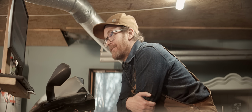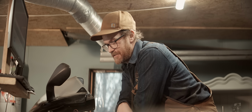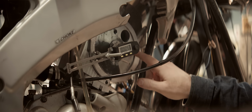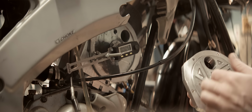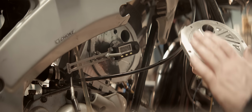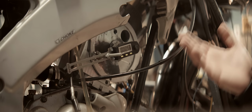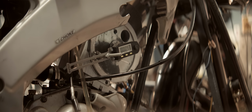Well, these are uplifting results nonetheless, because the engine is running, it's not overheating, things are working. I've pulled the rotary valve cover and everything looks better than last time. There's still some wear and there's still some black goo, but I think it's just unavoidable and it might go away after a little more running. I don't think friction in the rotary valve assembly is the problem now. There is some inherent flaw in here, and we need to find it.